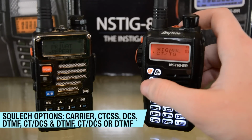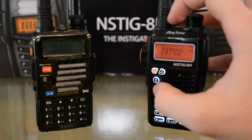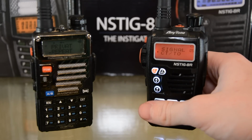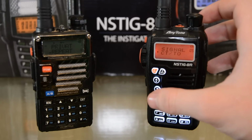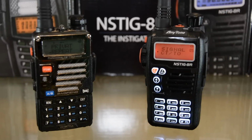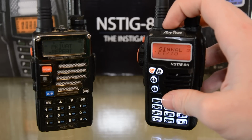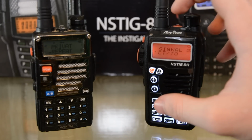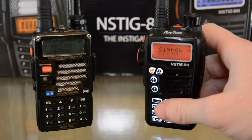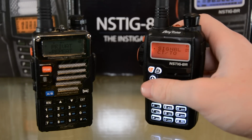So there's a lot of flexibility, a lot of options when you're out and you want to do something special with your frequency. If you're a commercial business and you want to have some kind of DTMF push-to-talk ID to open the squelch, for whatever reason, you've got a lot more options added onto the AnyTone series radios. Most of those DTMF options are going to be set up by software: what your push-to-talk ID would be, how it's going to receive commands, and what those commands are. A lot of those are in software.